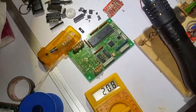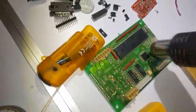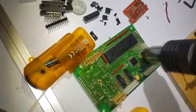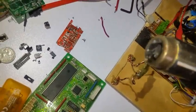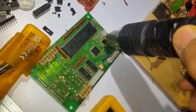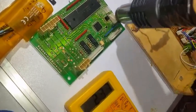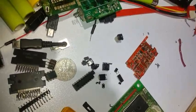I'm gonna increase it a little bit more. You gotta be careful with this handle because it has a wide output that exhausts the air out, and it can melt surrounding components and surrounding plastics. As you can see right there, it melted that, which is not a good thing to happen if you are trying to fix some kind of board.